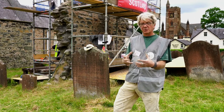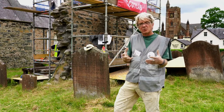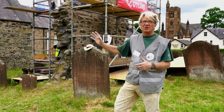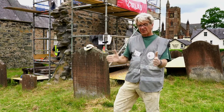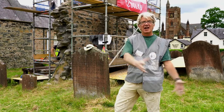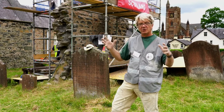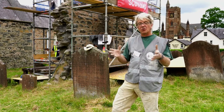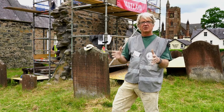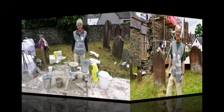It's a very good structural material when it's relatively dry, but mud eventually, when it gets wet, even when it's got some lime in it, will turn to liquid and flow. Not catastrophically here, but obviously if the whole building was built of mud, which very many are in the world, they will just suddenly collapse and slip out if they get too wet. So an earth structure should never be rendered or covered with a cement or indeed a natural hydraulic lime mortar, because inside they'll get wetter and wetter and wetter, and then the day will come when they'll turn to mud and slide. So yeah.